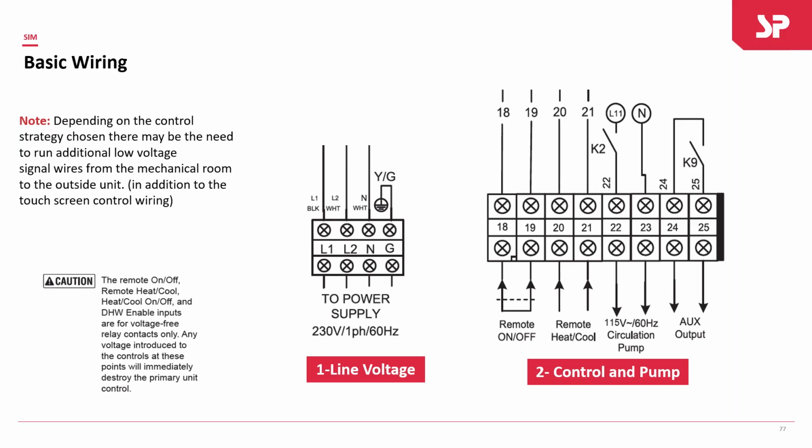From there, it's again relatively simple. We need just some low, no voltage, smaller gauge wires. We're talking 18 gauge thermostat wire control wires that are basically going to tell this unit, hey, it's time to come on, and it's going to energize or de-energize the reversing valve that we talked about in one of the previous pictures. That just decides what direction the refrigerant flows in. Am I sending hot refrigerant gas to the exchanger, or am I sending cold refrigerant gas to the exchanger? Okay, so it's all relatively simple. And this is also what makes changing out and upgrading older systems with newer ones so easy. They're so easy because we've used the same basic process for controlling these units from one to the other, regardless of the internal technology, of the advances in technology.